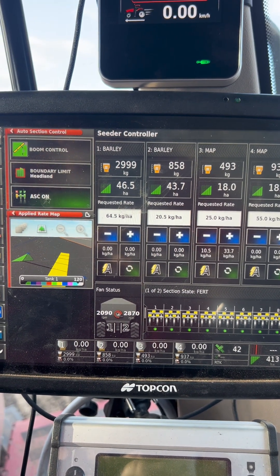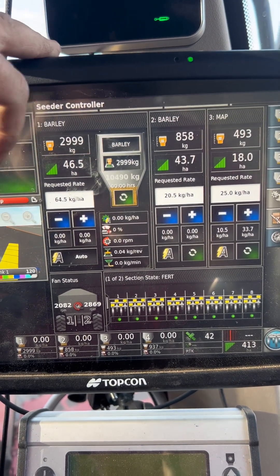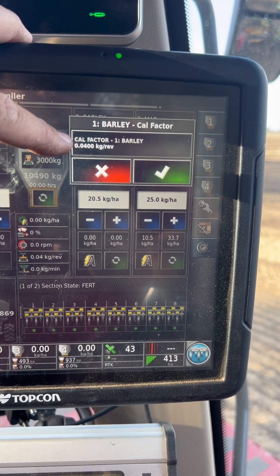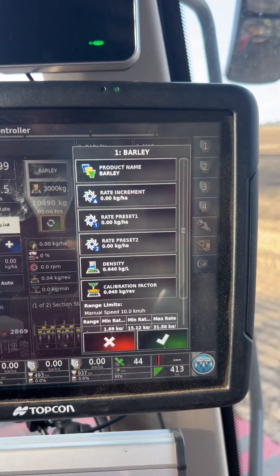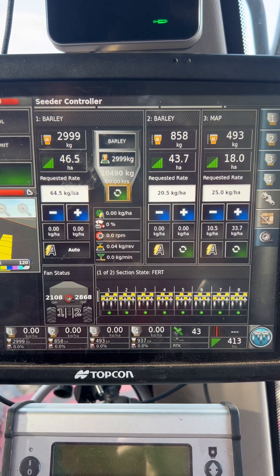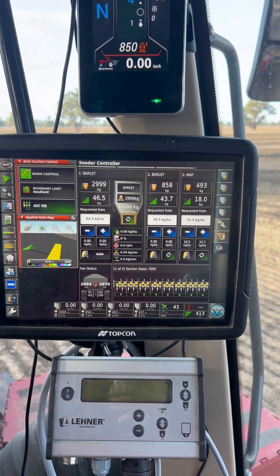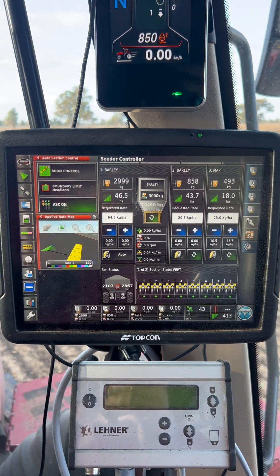The simple fact is that sometimes you just have to make that calibration factor up on the spot. If it's tracking 40% to 50% out, you might need to change this figure by quite a lot to achieve what you're trying to achieve. Again, if it's going out too light, lower the number. If it's going out too heavy, make the number higher. That's the only way I can figure out how to remember it — you get used to it after the first 50 changes that you make.